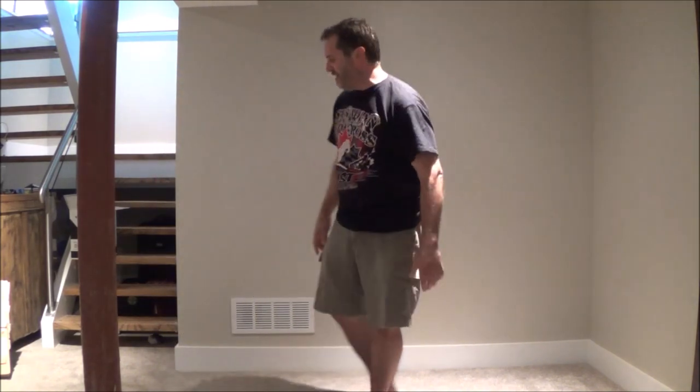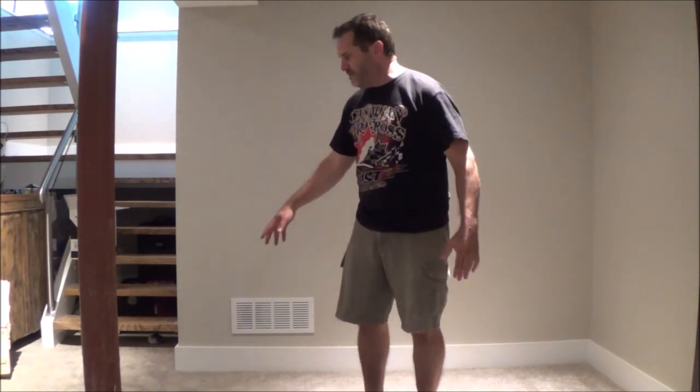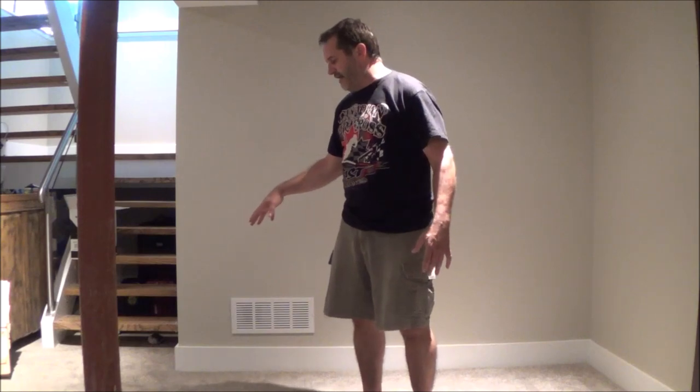We thought the least intrusive way to make a closet would be to extend the wall that comes down from the stairs about 28-30 inches and build the closet there. It doesn't cut into the room space much. In a nutshell, I'm going to remove baseboards, cut away the carpet, mark it all out, frame it, install a double closet door, drywall, and trim. The whole works from beginning to end.